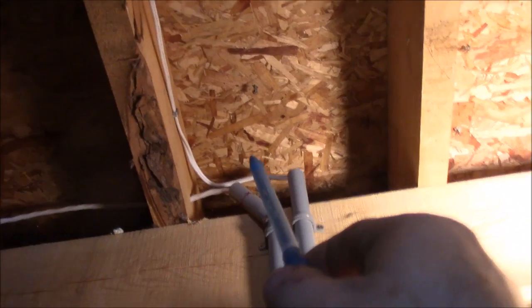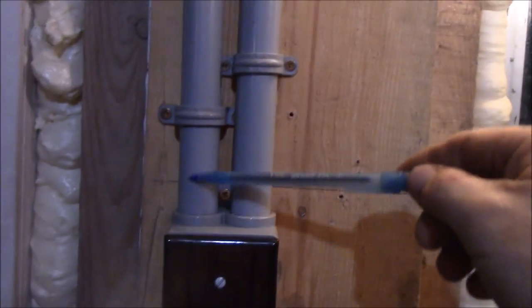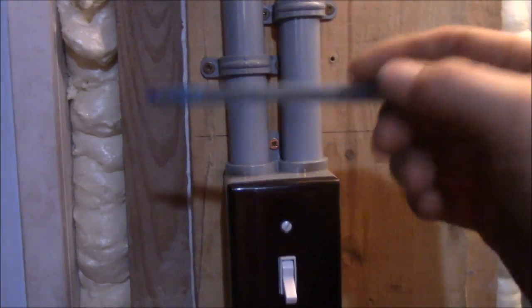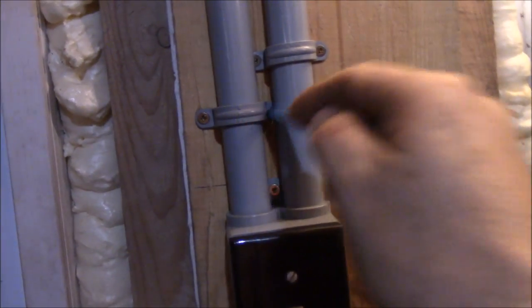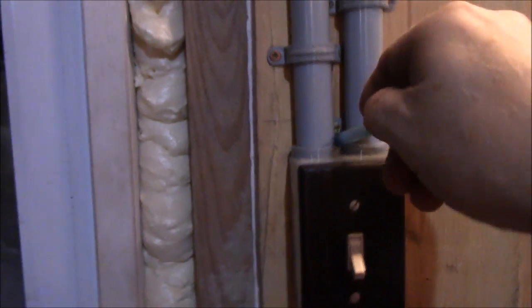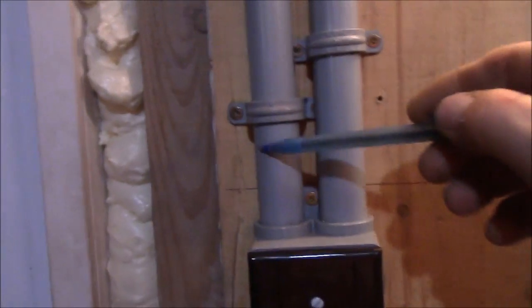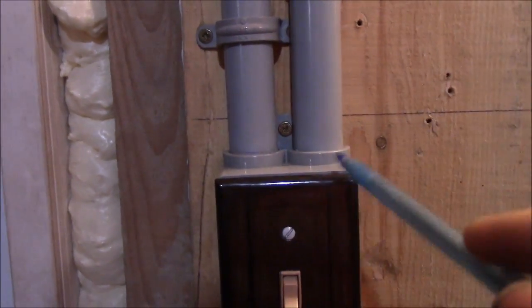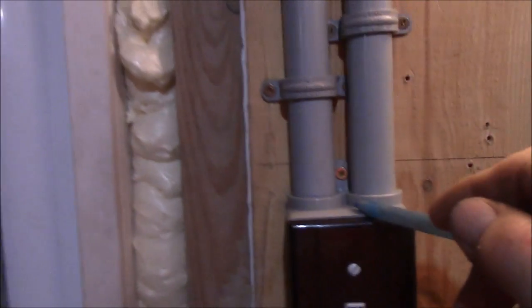The main question for you electricians there is that code. Now, there are no clamps inside here. When I bought these, the guys said they didn't think I needed a clamp in here. But if I do, it's just a matter of undoing these, sliding them up, and putting a clamp inside, because I didn't glue these yet. It's a matter of lifting this up, putting a clamp inside, sliding this inside the clamp, and then tightening the clamp. But there is no clamp inside these boxes.